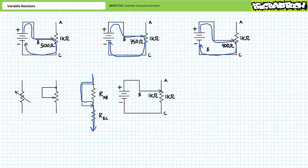Regardless of the schematic employed, consider the consequences of sliding the B terminal from one extreme to the next. If the B terminal is adjusted such that 100 percent of 1 kilohm appears between B and C, the source would see 100 percent of 1 kilohm and current might be regulated to a manageable small value. However, if the B terminal is adjusted all the way down such that 0 percent of 1 kilohm appears between B and C, the source sees no resistance and current might swell to an uncontrollable, dangerous level.